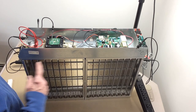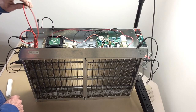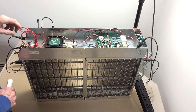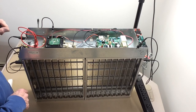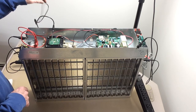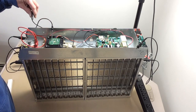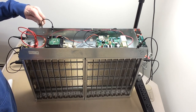Here I have a power box just sitting on top of the cells, and it will work that way. I have jumpered the safety switch for the door, so that's on all the time — otherwise you have to have a door on for this power box to power up. I've also jumpered the airflow sensor by taking the top of that resistor there on the airflow sensor and grounding it.